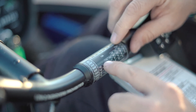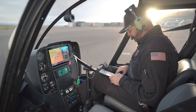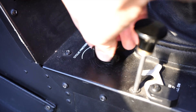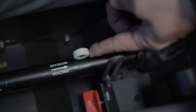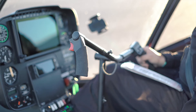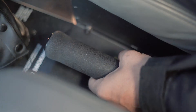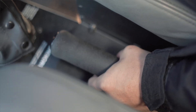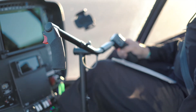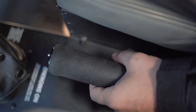Cyclic and collective friction are off. Time to check our hydraulic system. Hydraulic system switch is off. A small X pattern to make sure the controls work smoothly with the hydraulics off. A nice pull on the collective — it's going to be hard up, easy down. Our hydraulic switch is back on and we confirm the hydraulics work with the same movements with the cyclic and a smooth easy pull on the collective.